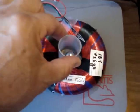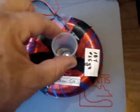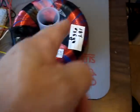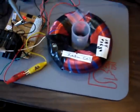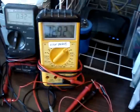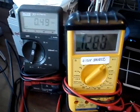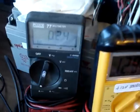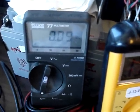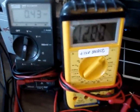The thing is funny — it feels like crazy. There's a feedback between the hall sensor and the coil, and so the thing totally freaks out. But what you want to see is, the faster it goes, the less current it uses. It probably goes up to 12,000–15,000 RPM.